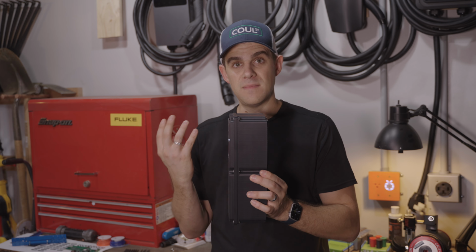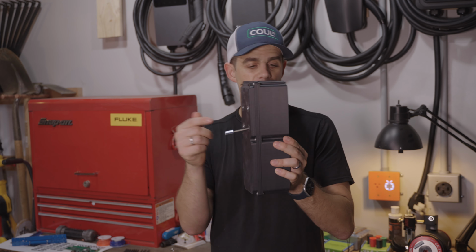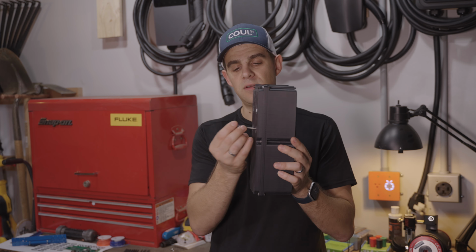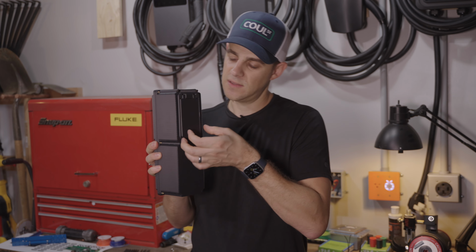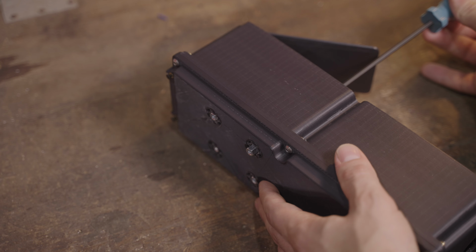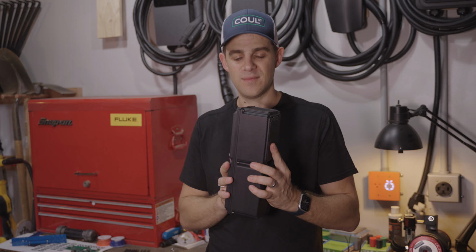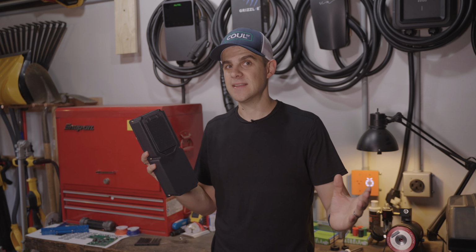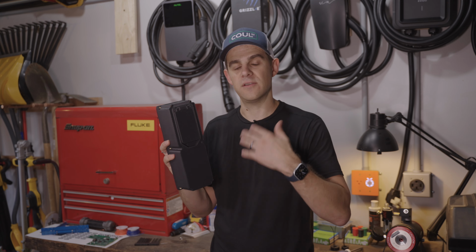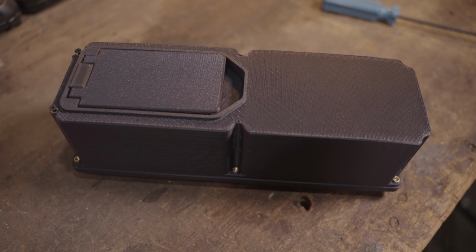We also tried out a different mounting mechanism in the box or in the post. You'll see there's these bolts here that go through the actual box. And on the back side of them is a little hex nut. This hex nut is tightened up through the mounting holes for the socket. And then you put the socket attaching screws on top of that once you get it secured into the post. So there's another interesting way to wedge this box into the post. We never did build the post for this. We never did build the electronics. We never tested it. It was really just getting form factor iterations updated. And so it's not a true prototype in that regard, but we still call it the Mark III.